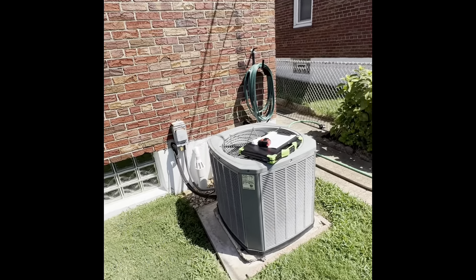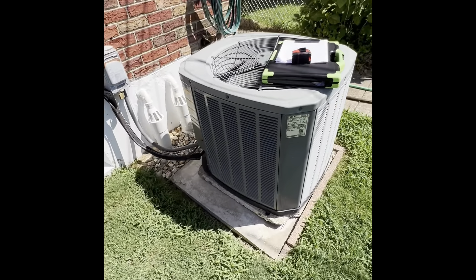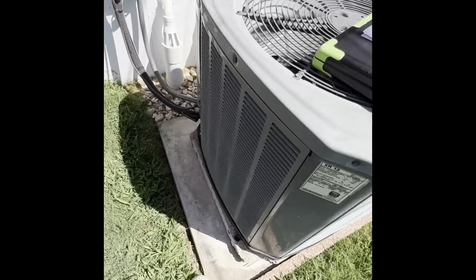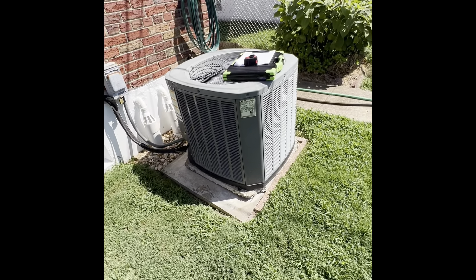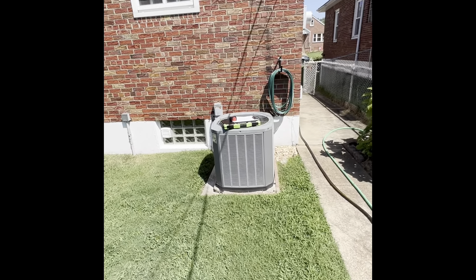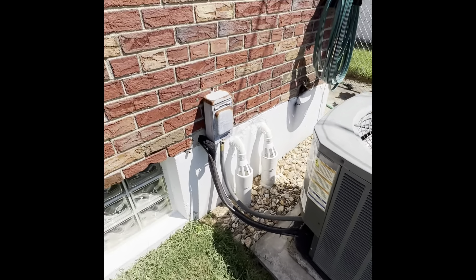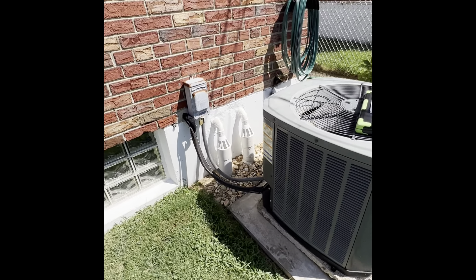Outside the Seriati residence looking at a possible full system replacement. We've got a two-and-a-half ton Trane unit sitting out here, 13 SEER, setting on a pad. I'll need to probably re-level it — pull up at least the top concrete pad. Looks like a heavy one underneath. Just get it re-leveled; not sure if we should do pavers or heat pump feet, as it has a tiny bit of a lean. We can add heat pump feet if needed. New electrical disconnect and whip coming out to the unit. We've got three-quarter by three-eighths inch line set; we'll flush and pressure test that.